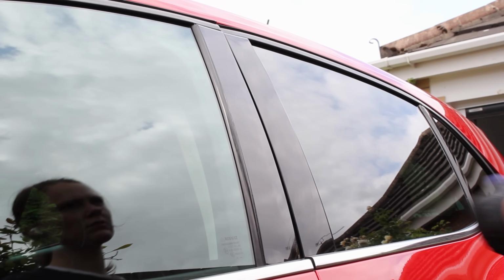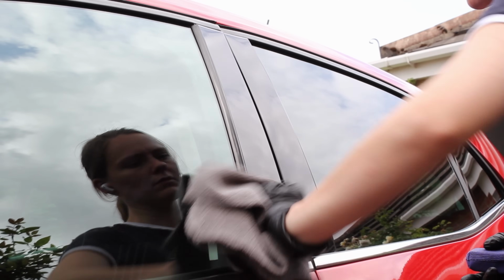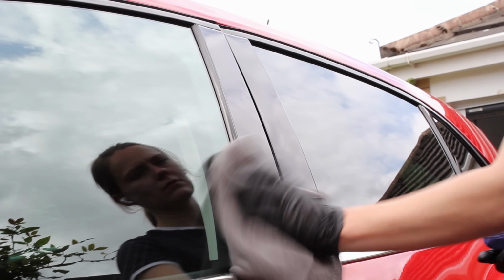Now, also, just be mindful of a couple of other things. You don't want to be applying it if it's super humid. If, say, it's a colder time of year and you're seeing actual humidity and condensation on the panels, then that isn't something that's going to work for coating application. You're going to need to do it another day.